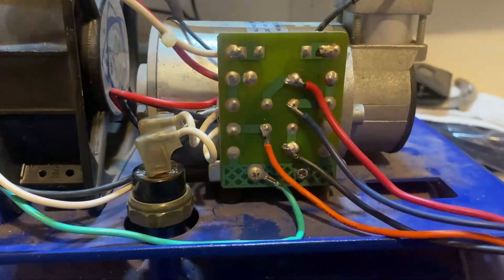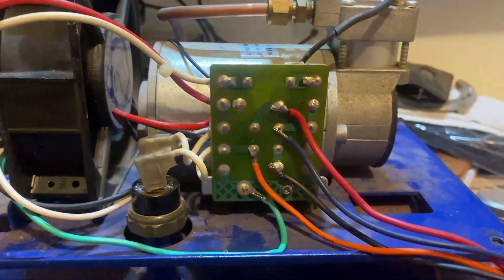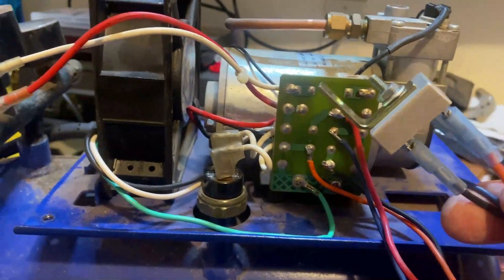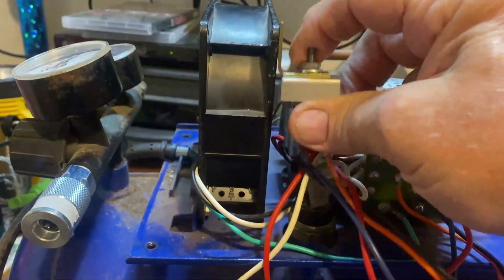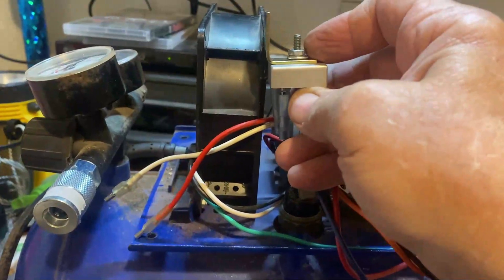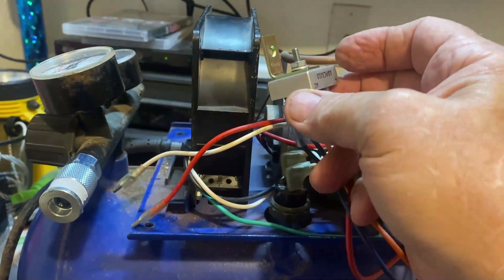It has a real light amp fuse in it. After seeing how that rectifier was wired into that board — it's really a very simple board as far as that goes — I had this behemoth rectifier, and I thought, even though it's big, if I can fit it up in here it should do okay. That fan housing is aluminum, so I thought that will be a good heat sink, and also when that fan comes on, it should do a good job cooling this rectifier down.